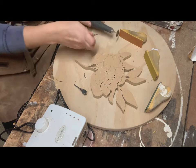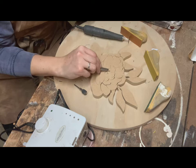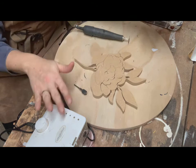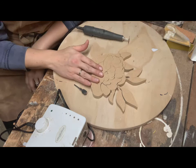These are carving bits that can also go into the rotary tool — great for adding detailing into leaves or carved details into the center portion. I also have my sanding sponges: a 220, a 120, and an 80 grit sponge. I typically use these after I've shaped with my rotary tool because the rotary tool is aggressive and can leave it a little wavy or bumpy, so these are used at the end to smooth it out.